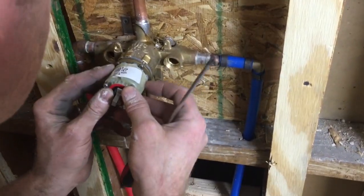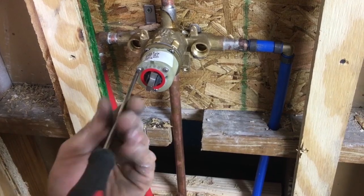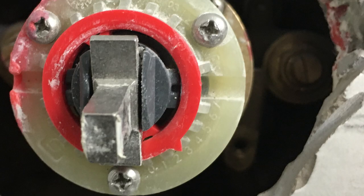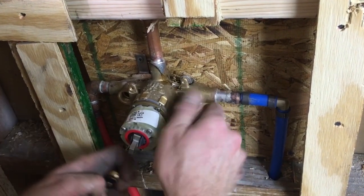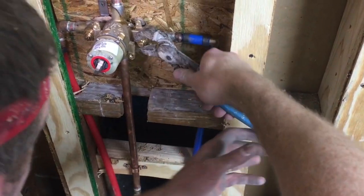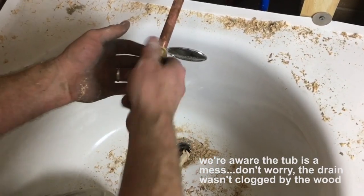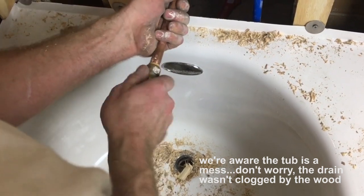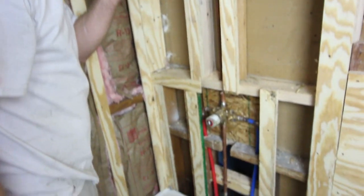Make sure your seals are in place correctly. Screw those three screws down and make sure they're nice and tight. On this American Standard setup, there's a little red arrow indicating the temperature — we put that on three just to make sure it wouldn't scald the user. Then you have your stops; put those in place, make sure all the rubber gaskets are appropriately set, and tighten them down using a pair of channel locks. Steve put together a little mechanism to test the pressure — you can also use a SharkBite fitting. He also put that mechanism up in the drop elbow and tested the pressure.